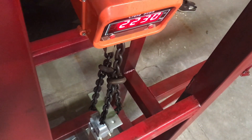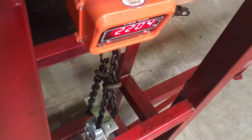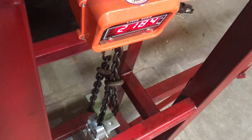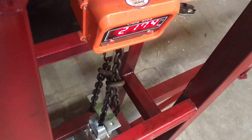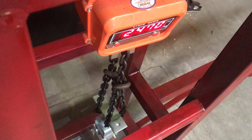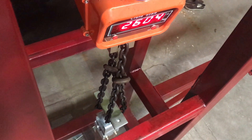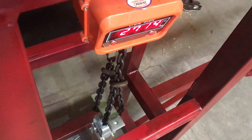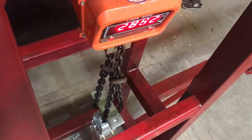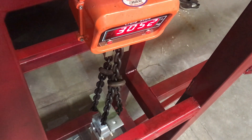So with your 400 kilos per screw — if you had four tech screws, four fours is 16, you'd have 1,600 kilos. With eight screws you'd be at three ton. And we're at two and a half ton, so we're doing pretty good. 2,700, 2,800 — it's getting harder to jack. There we go, three ton.